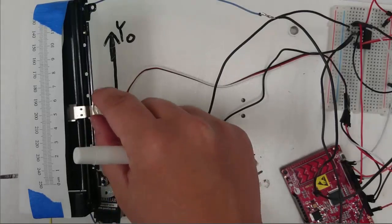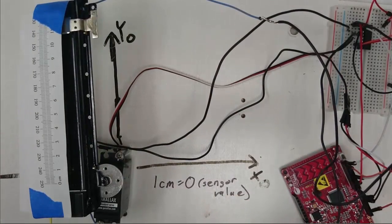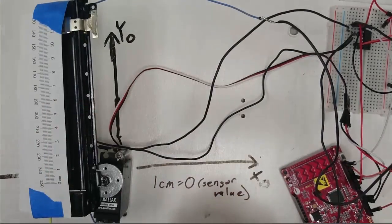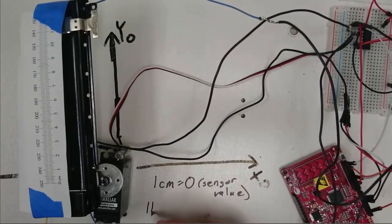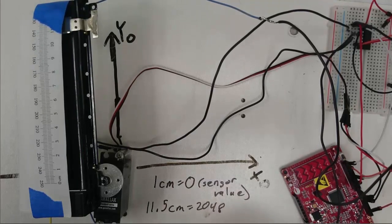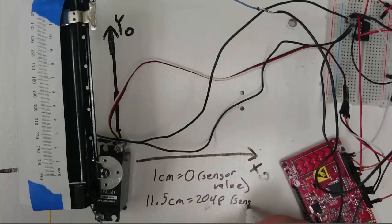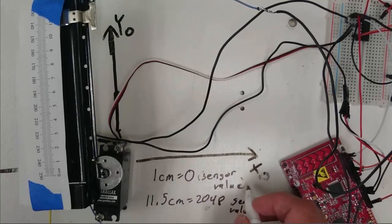Now, when I slide the slider all the way to the other position, its centimeter value is about 11.5. The sensor value here is 2048. The reason why it's 2048 is because the sensor value is a 12-bit signed value. So the largest value we can represent is 2 to the 11th. Okay, so now I have 2 points here